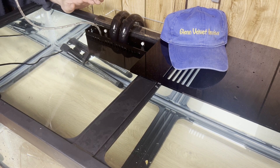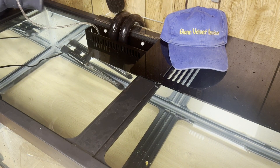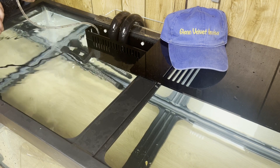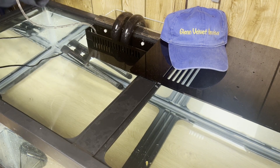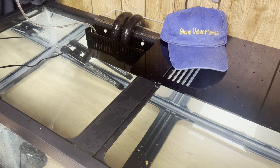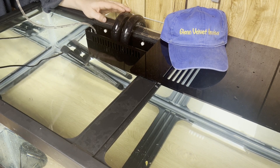This overflow is rated for 1200 gallons per hour, but you saw I have a small 550 GPH pump and it was still overflowing. So I'm going to test it out with the media removed — maybe without those inserts it can actually flow at 1200. Because as we all saw, with them installed the tubes weren't keeping up with just 550 gallons per hour at the spout.